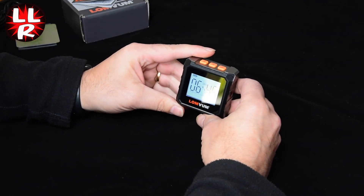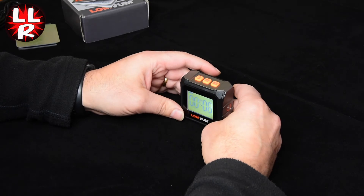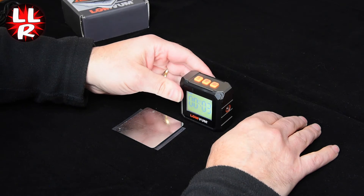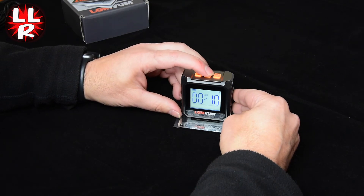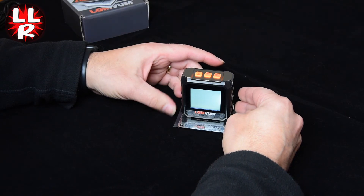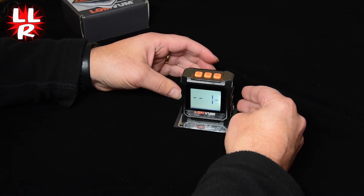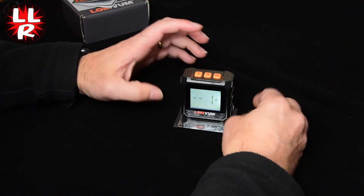It is possible to self-calibrate, though it's a bit tricky. You want a very solid surface to do it on — this surface here is probably not solid enough, but I'll go through the process anyway. Calibration uses the top middle button with a long press, which takes it to number one indicating calibration mode. The principle is the same as a 180-degree return test used for spirit levels — the surface doesn't need to be perfectly level, just roughly level.